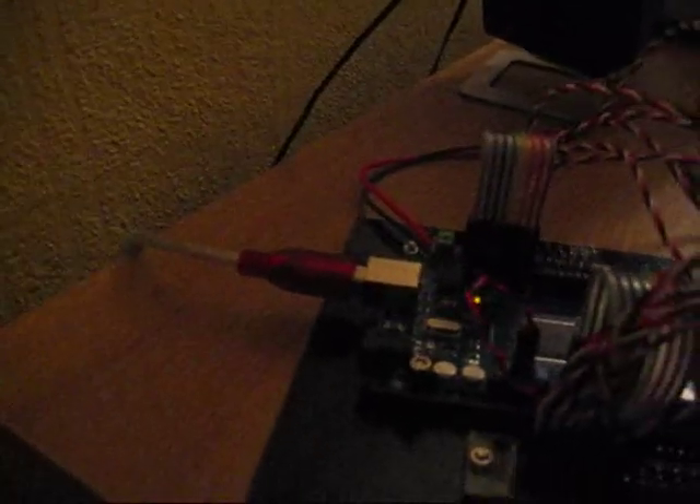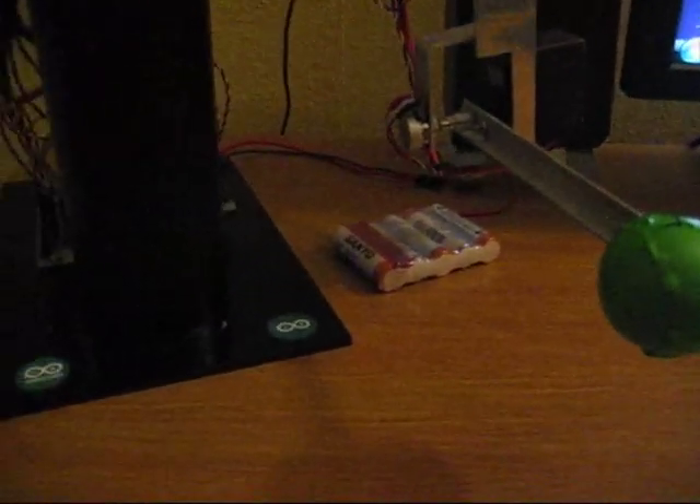If I come round the back, he's controlled with an Arduino Mega and some additional boards that I've made for interfacing the potentiometers and the servos, a USB connection to a PC, and a 6 volt battery pack for the servo power.